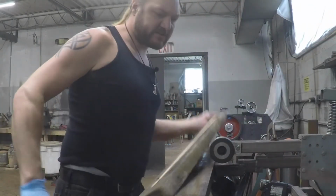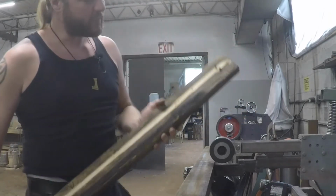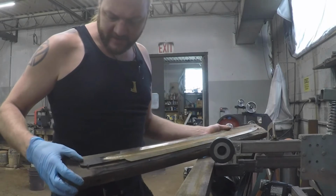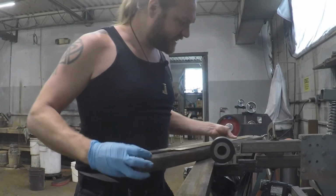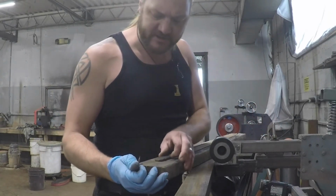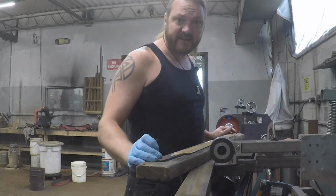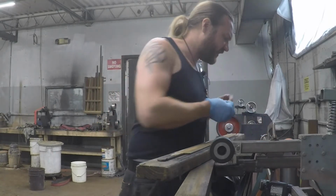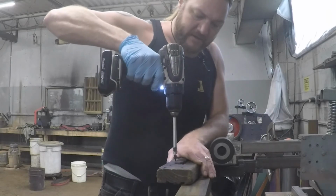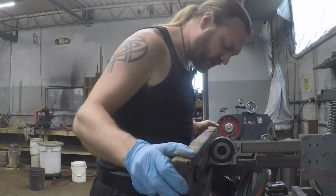You can see that what I've done is put a couple screws in here across the edges. So now my tip can go in here. I have another screw back here, and I just make sure that everything lines up nicely. Once I put that first screw in, I adjust it to make sure that this is going to rest on that center line. Also, it's a good idea to strike a center line down your sword so you know where everything's looking. And then you take your other screw, you snug it up, and there you go. Boom. Now you can sit here and go across.